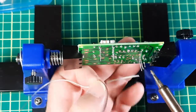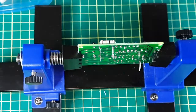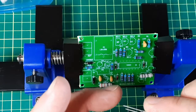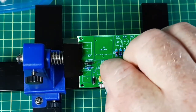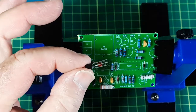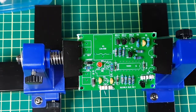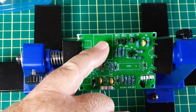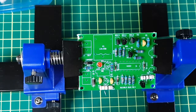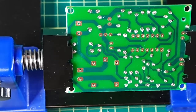I did actually have to straighten one resistor down here. Time to put the indicator LED in — anode being the longer one. And next the transistors; they don't come pre-bent, that you just have to work out yourself. So the transistors are in. Keeping in mind the numbers: there's one 9013 and the rest were 9012s, with flat side facing flat side. And all those are trimmed now.